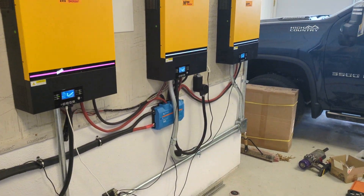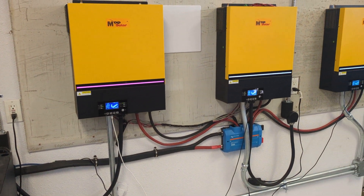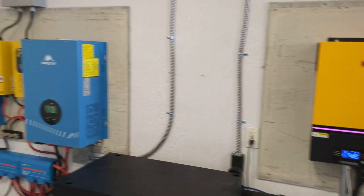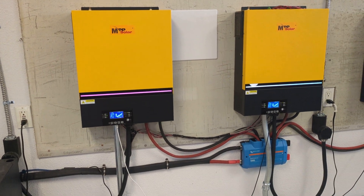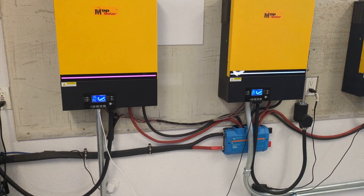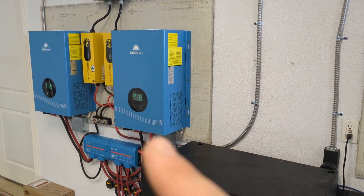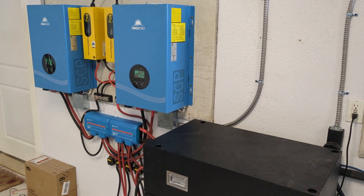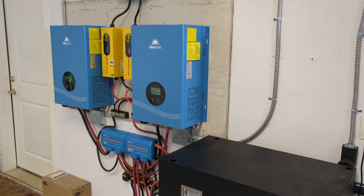I hope you guys appreciate this video and understand a little bit more about why this system is set up the way that it is. It's essentially so I can have a solar power setup that is always on battery — always online — no matter whether the source is grid power, solar power, or generator power. Those units never switch, so I always know what their state is. The problem with some of these types of units is how do you handle bonding?